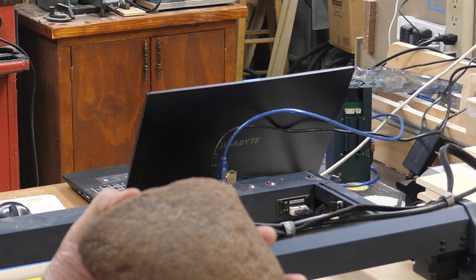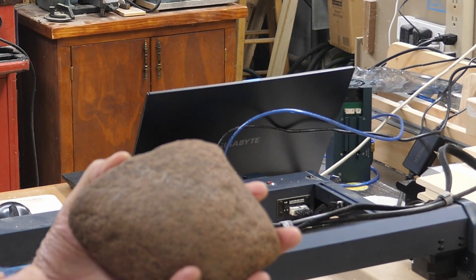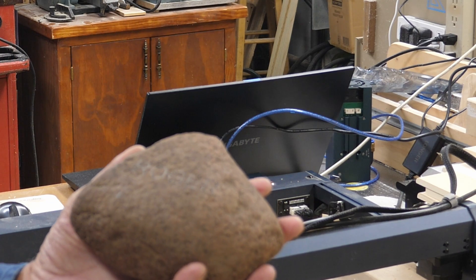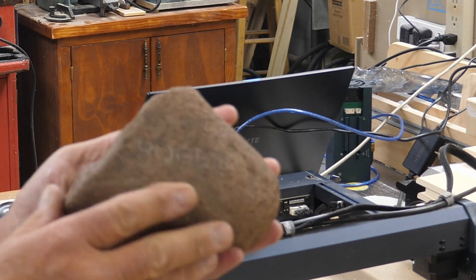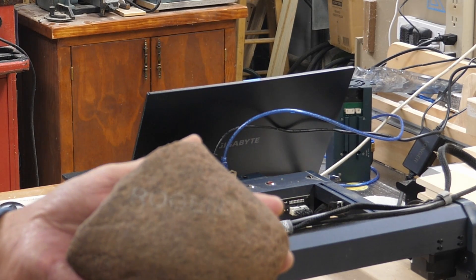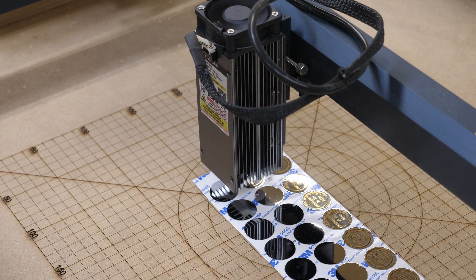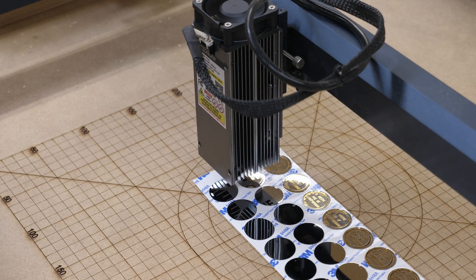Focus is extremely important with an infrared laser. With a blue diode laser you have a few millimeters you can play with — probably three or four millimeters of focus offset and you'd still get a good engrave. With the infrared you have one millimeter tolerance. This is a piece of red granite and it did etch my name in it just fine. Of course, with an infrared laser you can't actually see the infrared beam, but it does make a reflection on the material, so if you're going to be looking at it you'll want safety glasses or goggles rated for a 1064 nanometer laser.